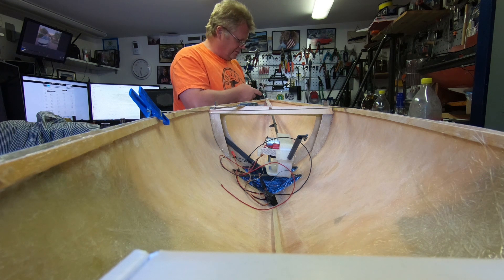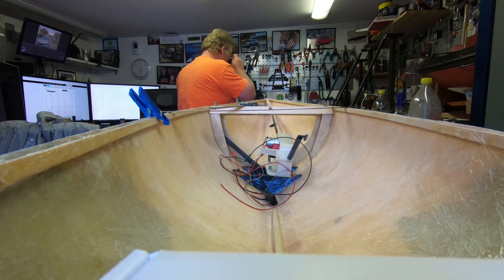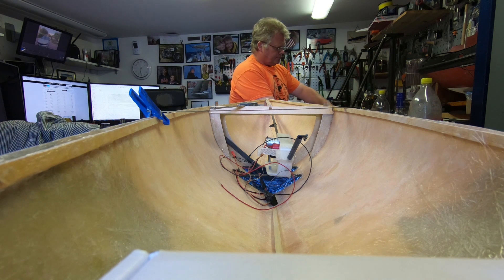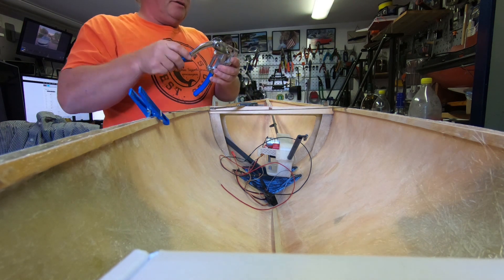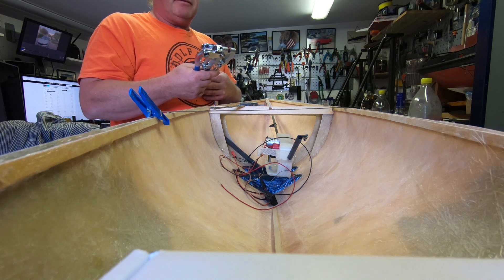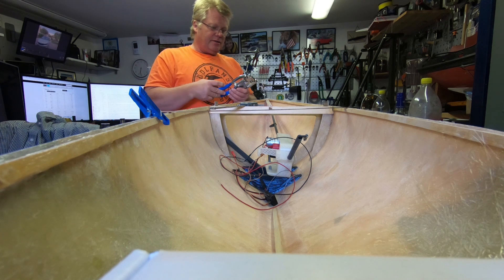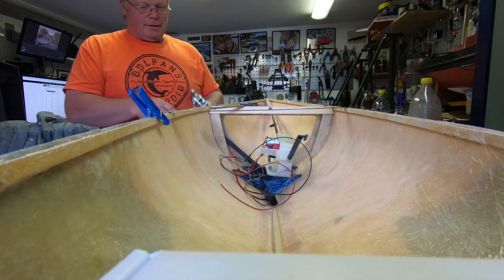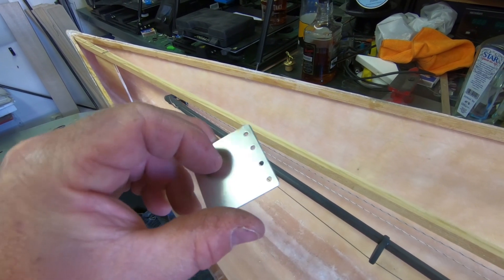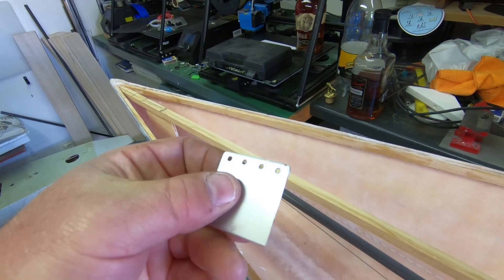This is one way of doing it, and I will put holes in this. I have a little tool for that — I love this tool. I'm not sponsored in any way, but this is for model making and it's awesome. It's got a kind of lever and you can punch holes up to 40 thousandths of an inch in stainless steel, or maybe even more. It's a really good tool so I can recommend getting it — I think I bought it on eBay. After punching holes with that hole puncher, this is just made holding the piece, so no expensive machines or anything. Good enough for me.